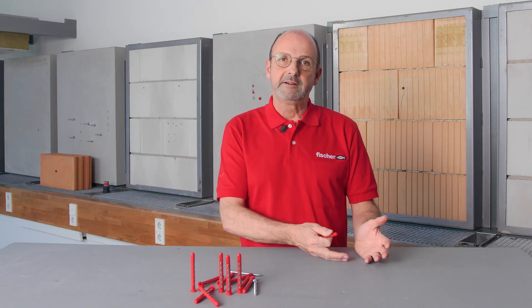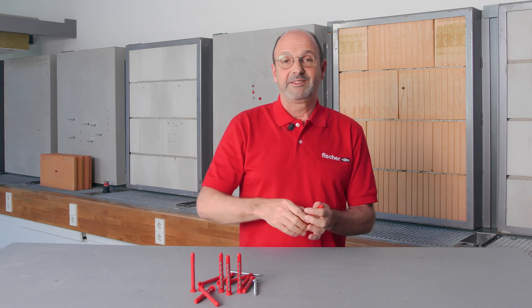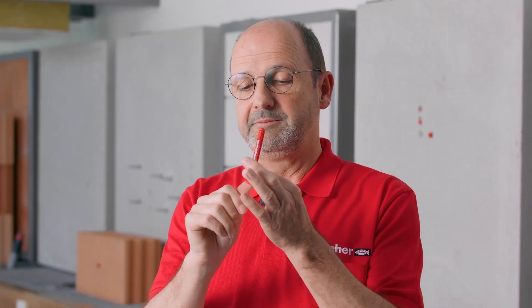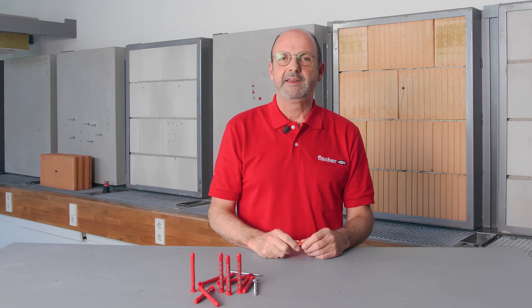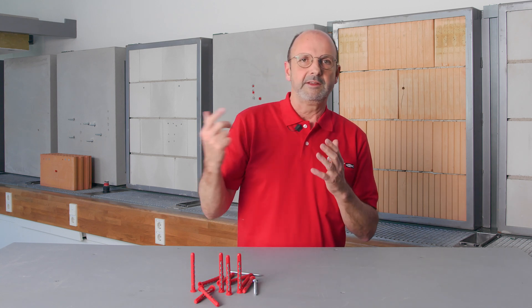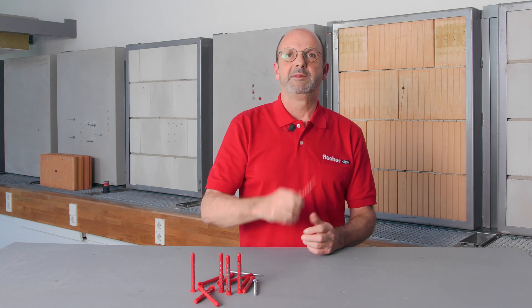Because I don't need any special tools. If you take a steel anchor in comparison, you normally have to hit it a few times, which is quite difficult for applications above your head. Here, you just basically push it in, lightly hammer the last centimetre, then drive the screw and fix your application. It's much, much easier to set than a steel anchor, and in many cases steel anchors are over-dimensioned — so this would be optimal for certain applications.